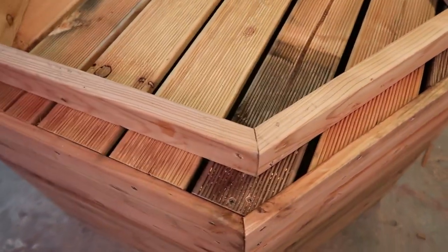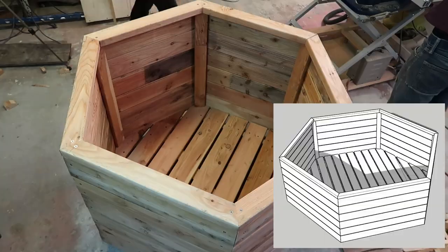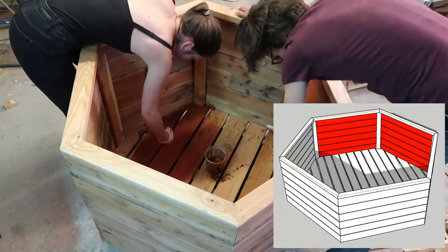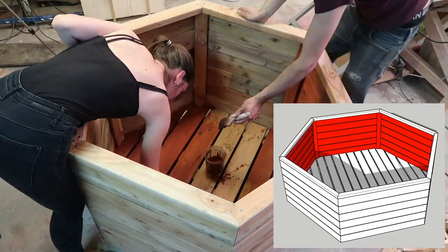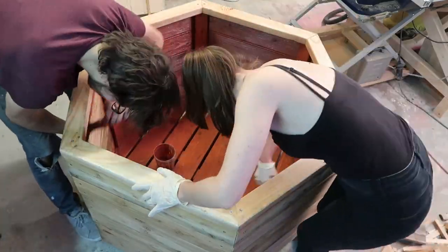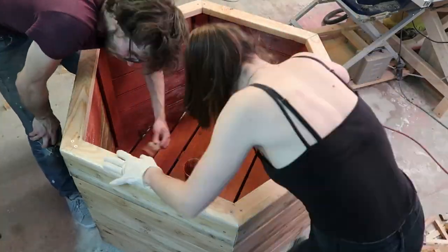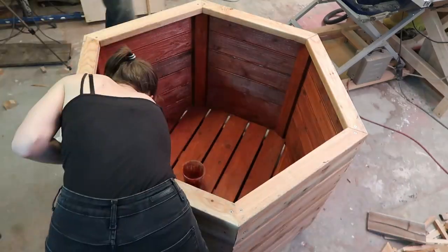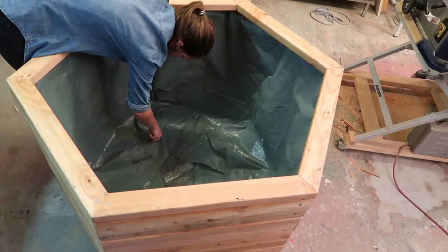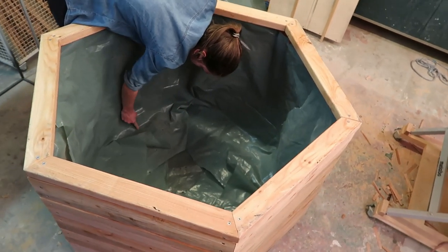The last few steps involve painting the inside with some kind of oily water resistant shmoo of your choosing. We used an oil-based sealer for decks from PPG. After you spread paint all over yourself and the floor you can cover up the inside with some heavy duty plastic and poke some holes in it so the water can escape. Now it's very important that you don't let the paint dry before installing the plastic — that way you can ensure that your clothes are going directly in the bin.